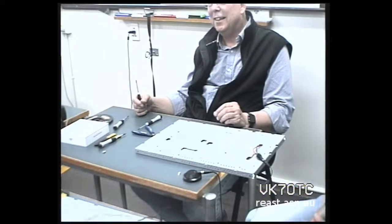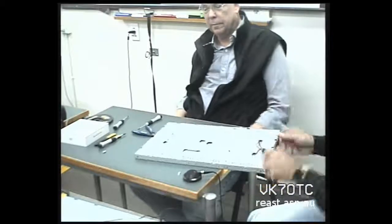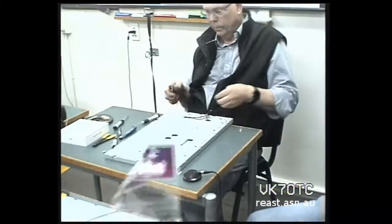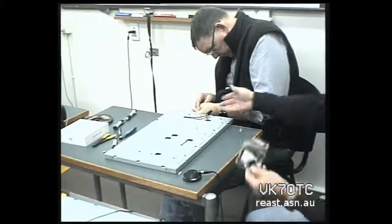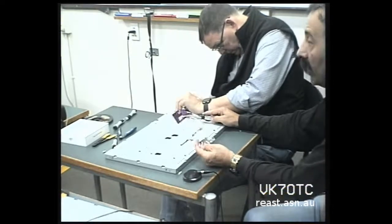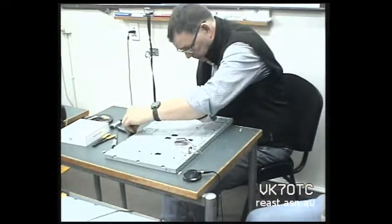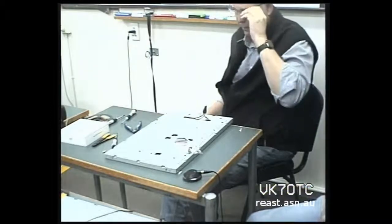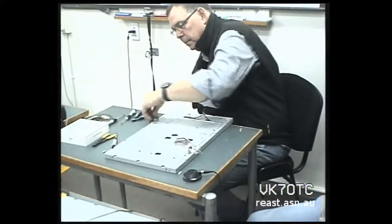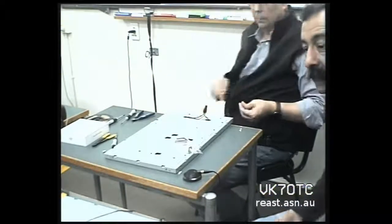We are using a little switch mode power supply here, which is a plug pack, and all we've done is put one of these little sockets with little screw terminals on the other side. You can see it on there. The reel of LEDs, how long is that? 5 metres. And what's that cost? About $36, if you know where to get it. This is the thin LED strip, the strip that's only 5mm in width.